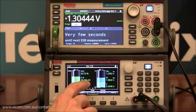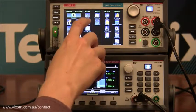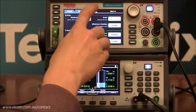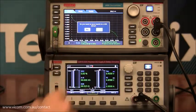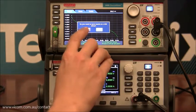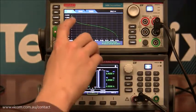You can see the state of charge going down, and the amp hour capacity left in the battery is also going down. If you want to see this battery discharge profile as it's going, go to menu in the 2450, 60, or 61, go to graph, and now you can see it discharging. If you want to see the whole thing, go to the scale tab and set x-axis scaling to all so you can see all of the points. Go back to the graph and now you can see the whole battery discharge model. In reality, a battery discharge would take days or sometimes weeks. When it's done, it says do you want to save the results to a USB drive — in this case, yes. It just saved that model onto the USB drive.